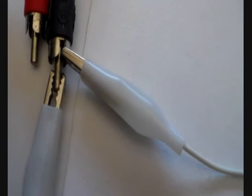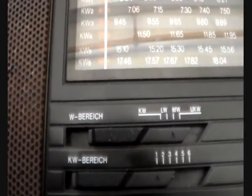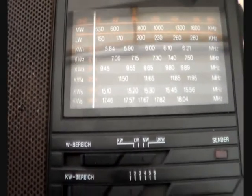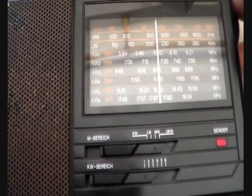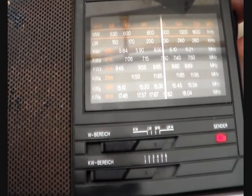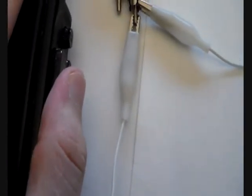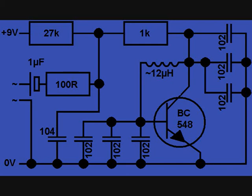On the other side you can see that on the RCA connector I have connected my alligator clips. The inner connection goes to the 1uF and the outer connection goes to ground. I have adjusted my walkman to an average volume — not maximum but also not the lowest, just an average volume. It should work. Now we are going to search for the station on the radio. I have set it to MW which means medium wave and tuned it to the lowest spot in the AM band. The transmitter should be around the middle of the AM band and you will find it if there is a silent spot in the radio. I turn on the radio — you will hear static but as soon as I find the AM station the static will disappear. There we are — now I have tuned my radio to the AM station and I am going to turn on my cassette player and we should hear the music through the radio.